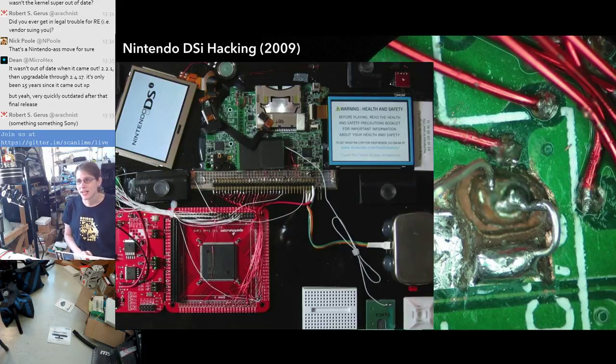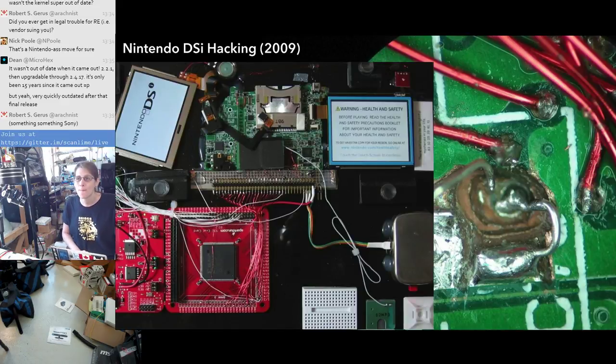And then the next step was actually getting in between the two so that I could end the SDRAM's packet and then take over writing the rest of the packet myself. So I actually had a list of triggers in the FPGA where if the system on chip was reading from any of those trigger addresses, then I could start injecting my own packets instead of letting the DRAM finish that packet. So that was actually how I inserted code into here.